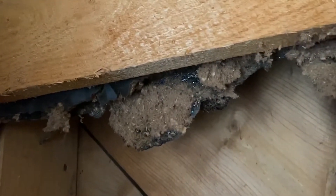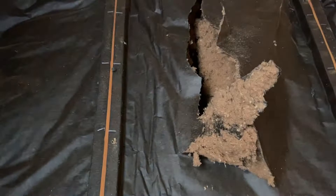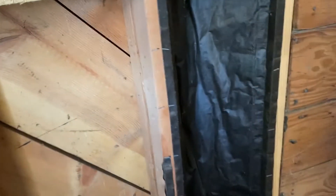If you're wondering why we're taking this stuff out, this is only about an inch thick worth of material, and we're going to replace it because it's just not substantial for modern code. Since we're putting mini splits in here, it's not going to be substantial for the mini splits to keep this place warm and cool.